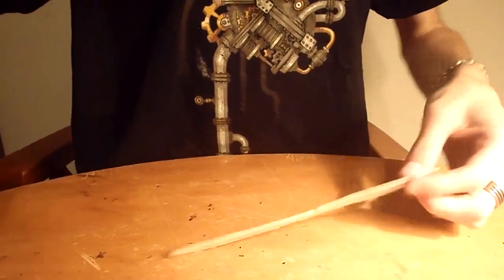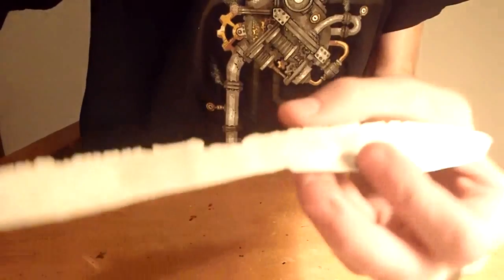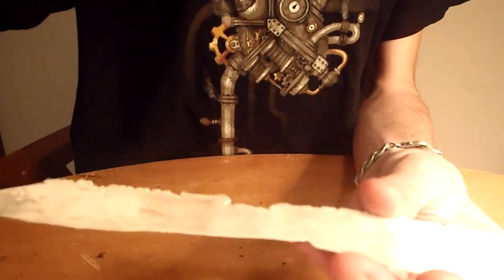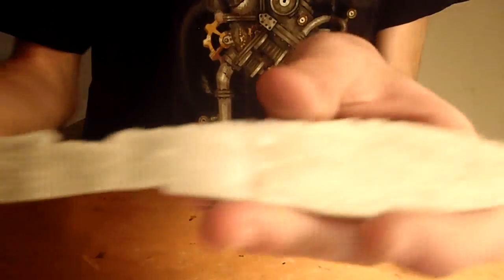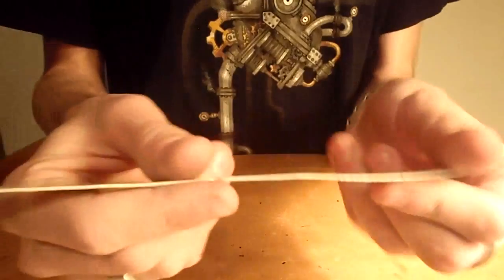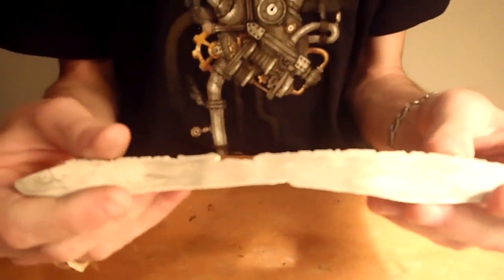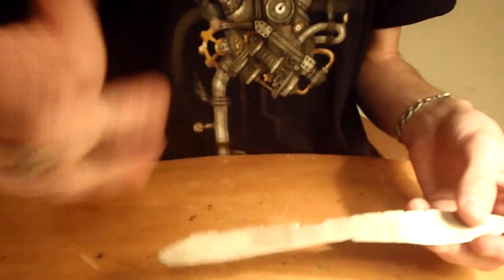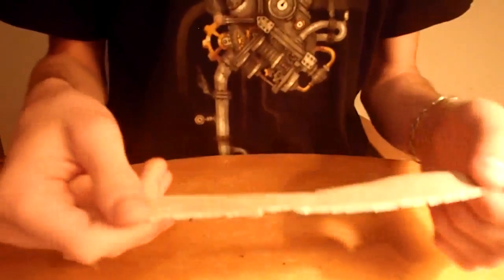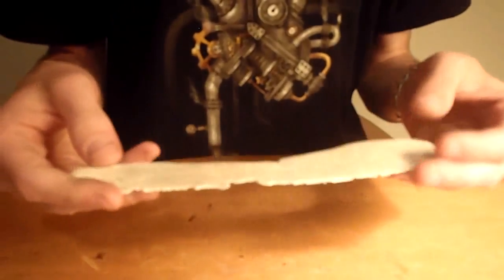So after rolling the silver into a sheet, this is what I'm left with. You can see that it is a slightly odd shape — our roller really has a fixed diameter that it can accept metal in without turning it into wire. This is what I'm left with, but it's flat on both edges, and with the exception of this part which is very sharp and jagged, this side is very smooth, and it'll be very easy to use this to make rings out of. Rings similar to the one that I wear in all my videos. It's shiny, it's polished, it came out of the pickle ready to be used for construction of jewelry, and this is exactly what I wanted after all of that smelting.